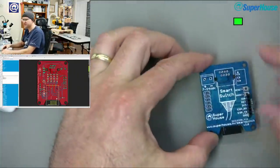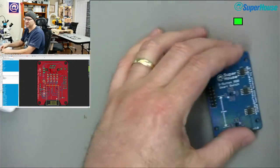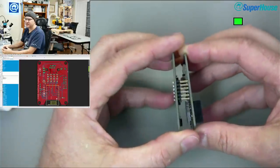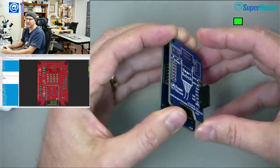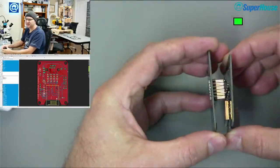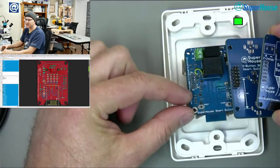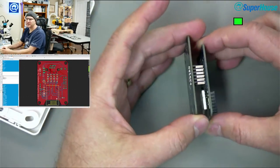This is the updated version — this is the control board, and this is the updated button panel board. The idea is that this will have a socket on it so that it goes onto this, and those two will be sandwiched together. I could do it by mounting this on top and soldering it directly, which would be very low profile, but you'd never get those boards apart again without a whole lot of work. So for the test version I'm just going to put a socket on it. You can see that one of the differences is that I switched to 0.1-inch pin headers on here, whereas on here it's 2mm pitch pin headers. So it's a fairly low profile gap between those two boards.